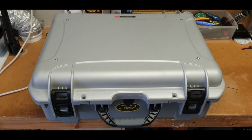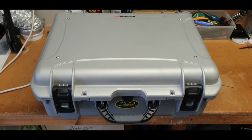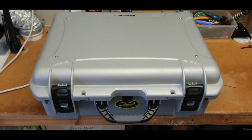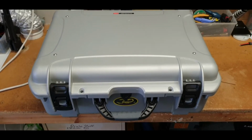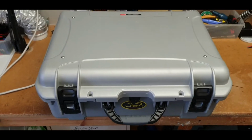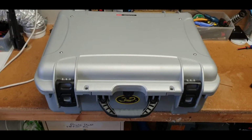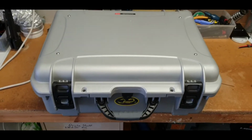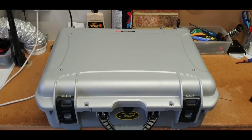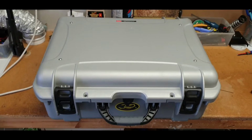This was one of the early cases where I did that, so I used a wire connection going from inside the case to the lid. So of course every time you open and close the lid, it fatigued the wire, and then over time it would break. We also wanted to upgrade the wireless charger in that to a fast charger one. Again, I was learning the difference between the cheaper options that were able to be taken apart and incorporated into a lid to be as flat as possible.